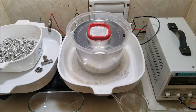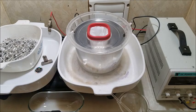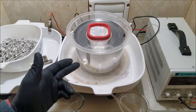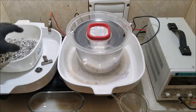The solution that I mixed up last time was 140 grams of silver per liter in solution. And I fit about 1.5 liters, 1.4 liters of solution in this bowl. So now I'm only working with 210 grams of silver. That's a lot less. I'd rather have that little bit of cement silver laying around instead of all the other stuff. Much rather have silver crystal.